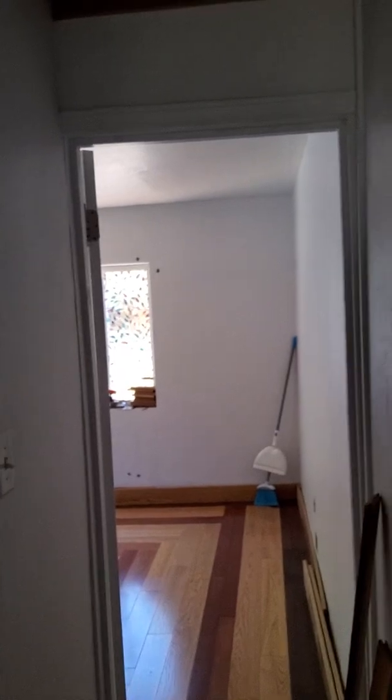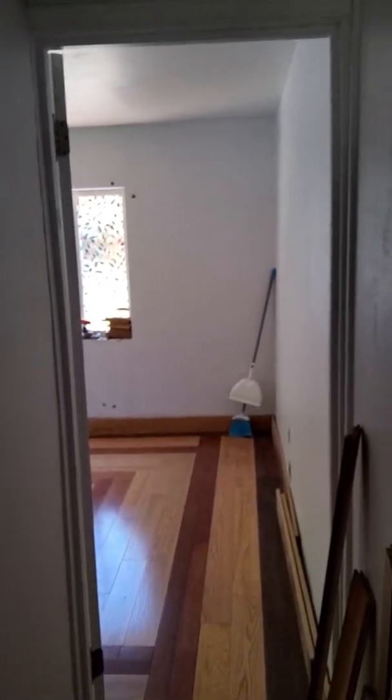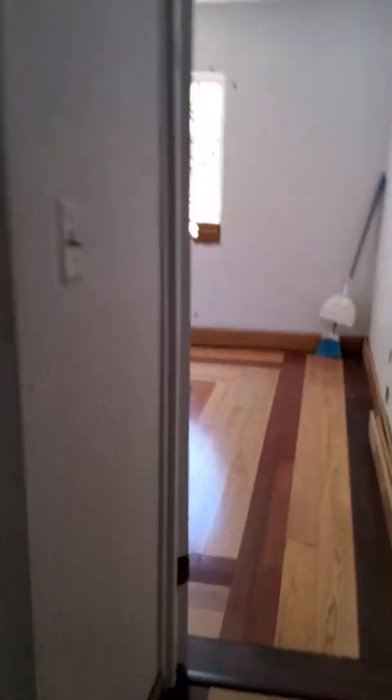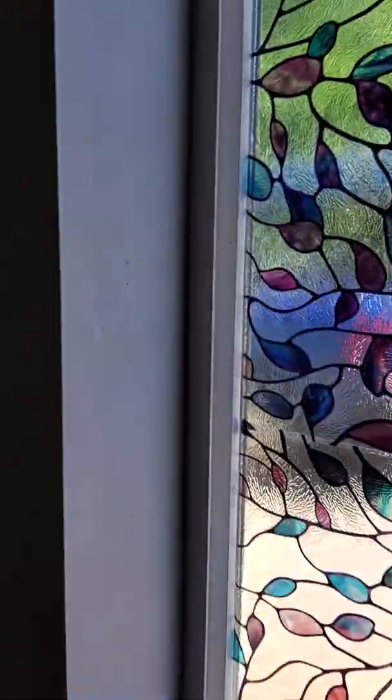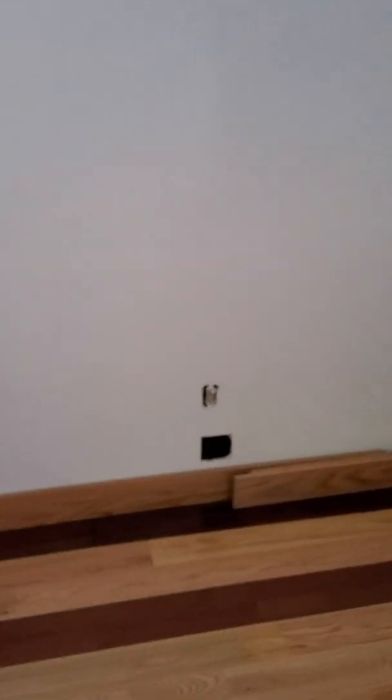I went in the attic, and it is scorching hot up there. The only ventilation in that attic is a small gable end vent and the other gable end. There's no soffit vent. Technically, when you have a gable end roof, you get 3-point ventilation because you usually get soffit or eave block vent, and obviously we don't have that, so there needs to be some vents put in. Probably the best bet would be doing ridge vent, since you have to replace the roof anyway.